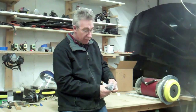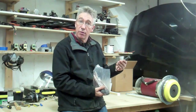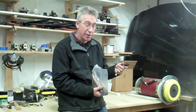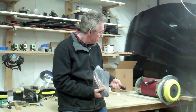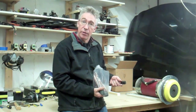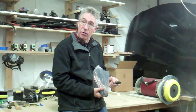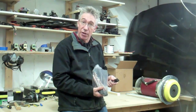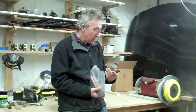carbon brushes, which I'm pretty excited about. I'm going to have to put them in now and seat them in for 5 days. So I just wanted to let you see how the motor's running after seating it in with the original brushes. And remember how noisy it was. It's quieted right down. It's really quite great.